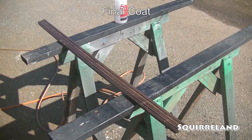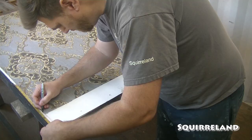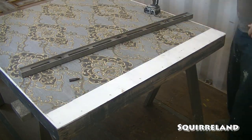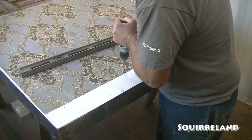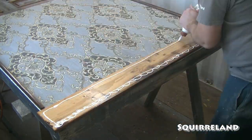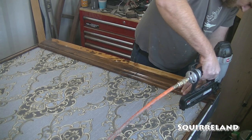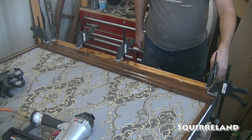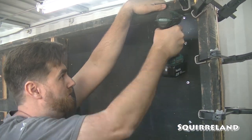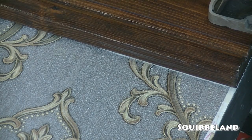With all of the painting nearly complete, I can finally move on to the final assembly of all of these trim boards onto the panel. To make things easier on myself, I mark and drill pilot holes in the panel for the screws that will be screwed into the crown molding from the back. I also temporarily place the side trim boards in their spots to make sure that the crown molding will be nailed down in its correct spot. I nail the board down with a few finishing nails to hold it in place while I clamp it. Next, I flip the panel up on its side and screw down the trim board from the back.